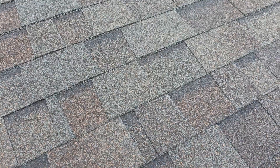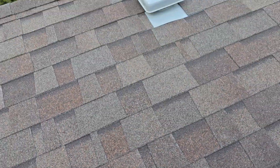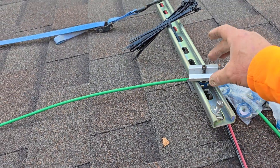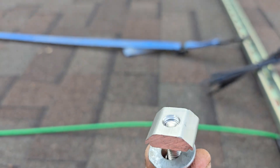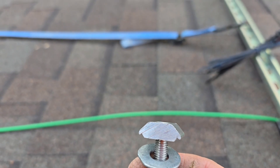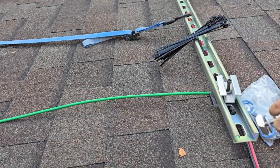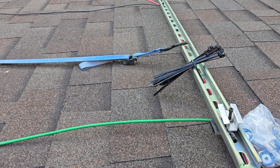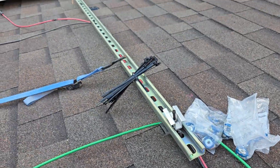From Amazon I bought these T-bar nuts, and they come with this little piece here. On Amazon the picture showed that cross piece as one inch — or it said 1.14 inches across — but in actuality it's under an inch, about 0.93 inches. So you can see the problem: when you put that in the channel, it's just too small. Compare that to the one from Home Depot — see how much wider it is.